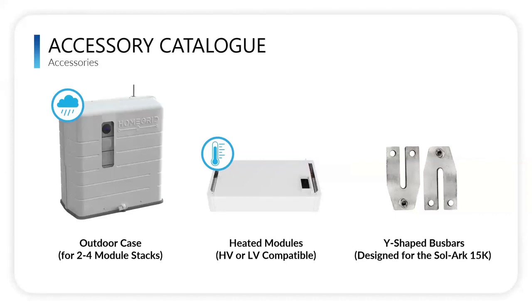Yeah, I'd love to. So we are an IP55 rated battery, which means we are water resistant, but we are not waterproof. And that water rating comes when the battery is stacked up. So like Joe was mentioning, when they're in the box, they're not waterproof or water resistant. So keep them out of the weather for sure before installation. And we want to try and keep them out of really heavy weather, like driving rains, snow built up around them if they do need to go outside. So this is our solution for that.